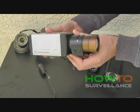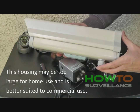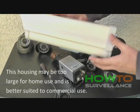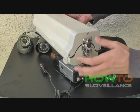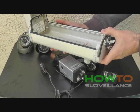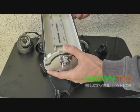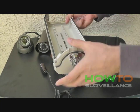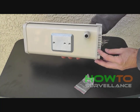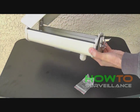This type of camera, as is, is best suited for indoor use. It's not waterproof, so you don't want to use it outdoors. To use it outdoors, you'll need some sort of protective housing. Here's an example of a typical housing for a box camera — it opens up, and the box camera mounts to the base of the housing to be protected from the weather. Many housings also have wiring for fans that can be installed inside to provide cooling air for the camera, which prevents it from overheating. This particular housing has a base plate for mounting and an opening for cable management at the bottom.